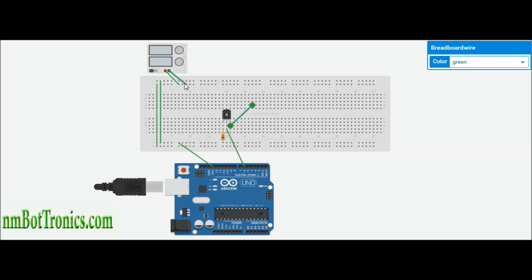As you can see in the pictures I showed earlier, your LED strip has a white, a green, a red, and a blue wire. Your white is going to be power for your positives. I'm going to make this so that the red on the strip is hooked up here — red here, blue here, green here. This is going to be our power right here, so I'm going to tie that into the positive. When I plug in my LED strip I'm going to make sure the white wire is hooked up to power, and then the next one is green, then red, then blue at the end.